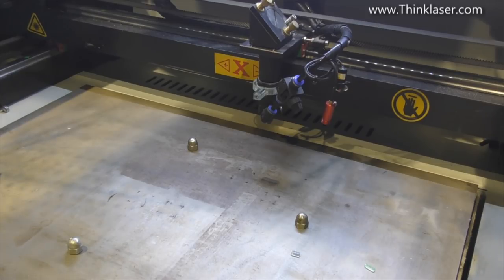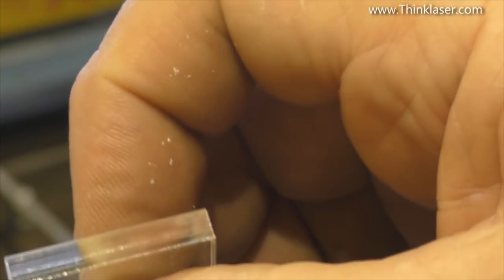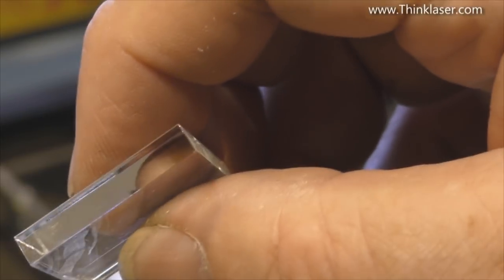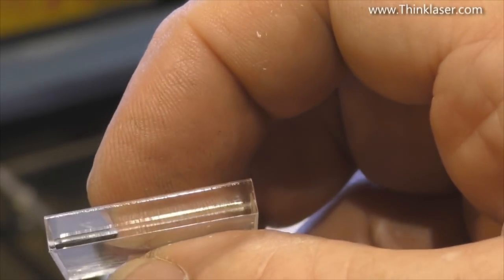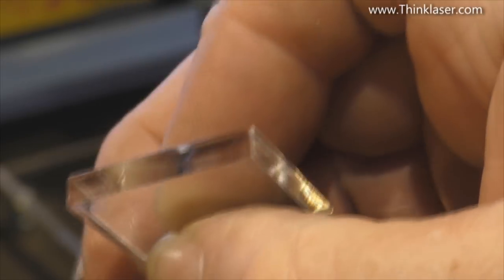That's because we've got this liquid phase kept in the cut. Let's find a piece of 5mm cast acrylic to compare it with. Repeating the previous three tests - with air assist you can see every single mark on the surface. Same test without air assist: nice vertical striations induced by the stepper motor. Now at half speed with no air assist - I just put that on my lip and it's very hot. And all of a sudden, even though this is cast acrylic, we've nearly got that mirror finish - just a hint of striations in the background if you look very critically.